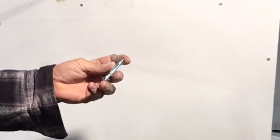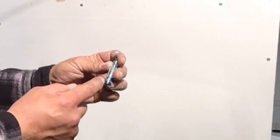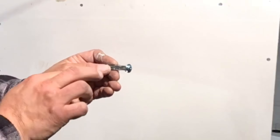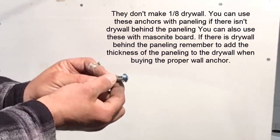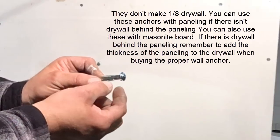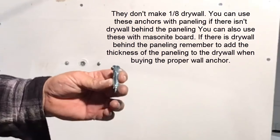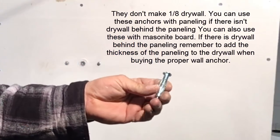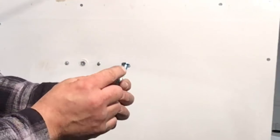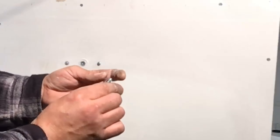So I have a wall molly — a hollow wall molly. They have several different sizes. This one is meant for 1/8-inch to 5/8-inch drywall, and this shaft is the depth of what you'll be mounting it to. The next size up covers 5/8-inch to 3/4-inch drywall. We have to pre-drill the hole for this one. It has several little pins to hold it in the drywall and lock it in while you're tightening it.